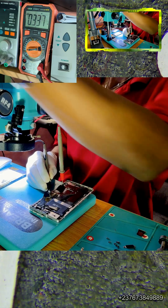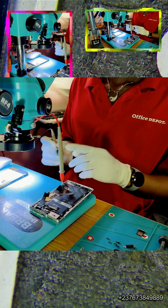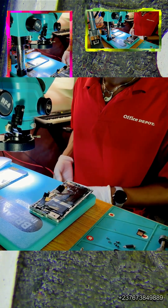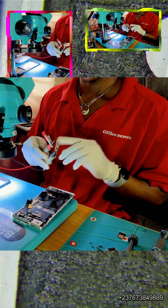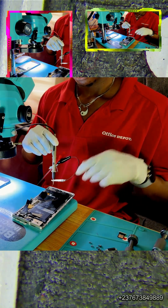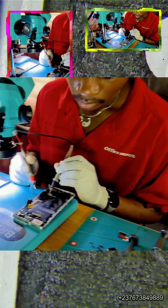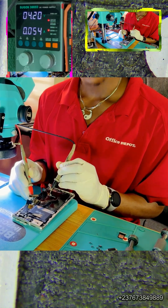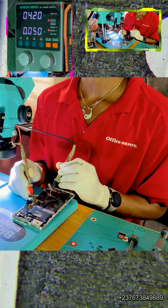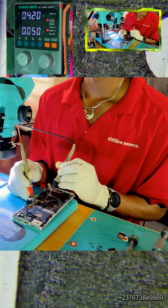I tested the reading of the battery connector. That's a good reading for the VBAT line — 337. That's a very good reading for the VBAT line, that's okay. So now I use my DC power supply to inject voltage, power on, and voltage at the VBAT, which is the battery connector. I inject 4.2 volts and you can see a small current leakage — that's the current leakage that I was talking about.